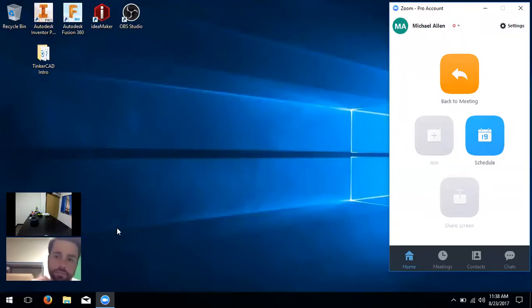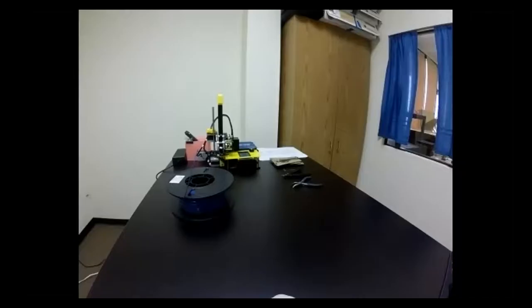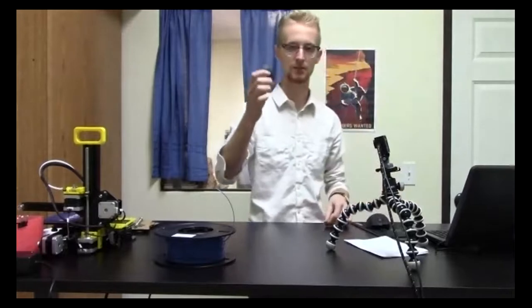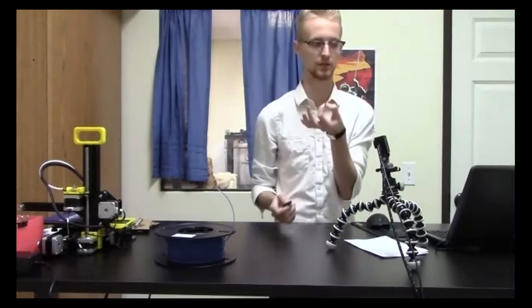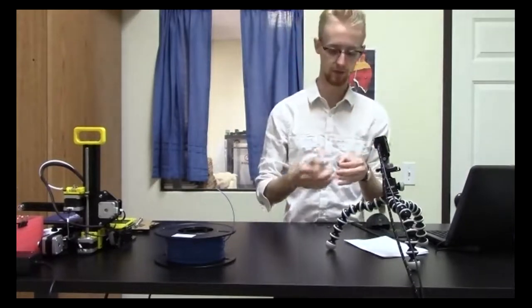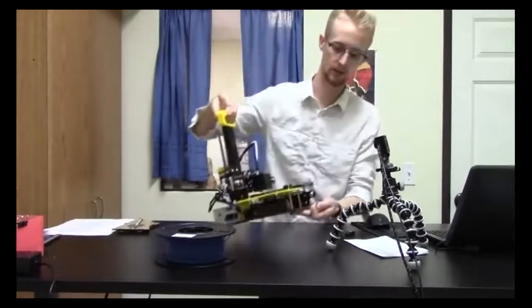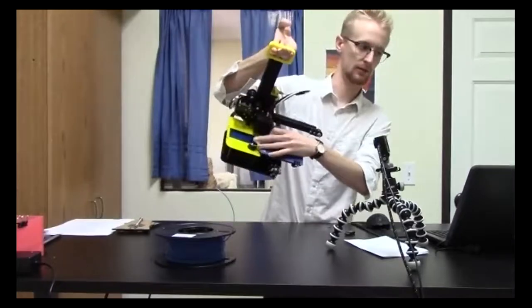Now that we have our USB with the small SD card in the back, we can pull that SD card out — that's what goes in the printer, as the transfer step. That goes right to the printer below the big button. There's a small slot next to a micro SD card slot just below the main button; you should hear it click into place.